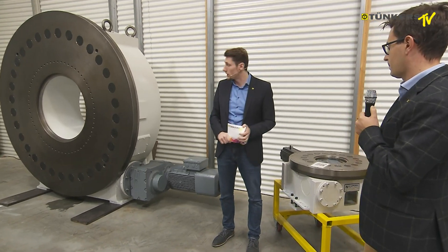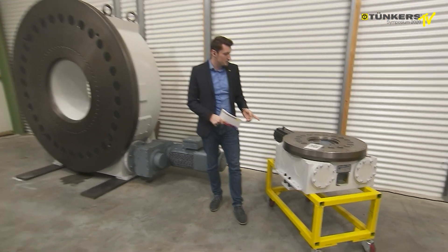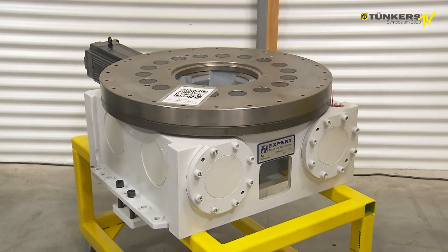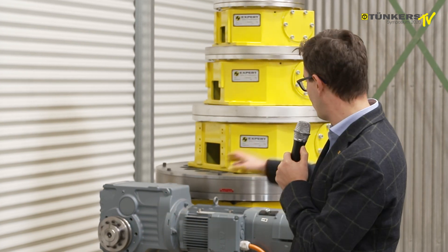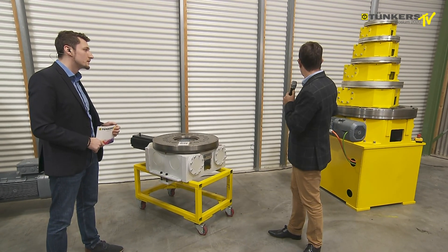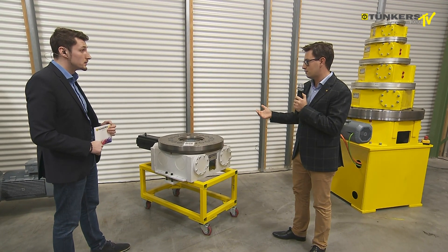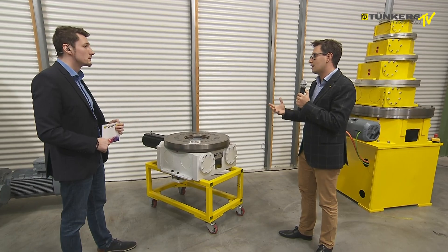So one design and two drive units. It looks a bit like the Stargate. On my left there is a smaller table — it's quite interesting for a couple of applications. What is the difference from other rotary tables? Nothing much for the customer — they can swap this. For instance, the plate diameter is the same as the EDH M69, but we have double the torque because we use two cams, so everything is double. In this case we would have 8,000 Nm here, and 16,000 Nm for customers which need a higher force or a drum with a higher imbalance. This can improve the dynamic of a system.